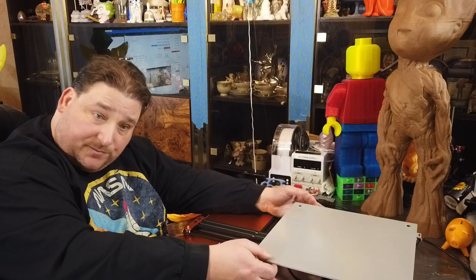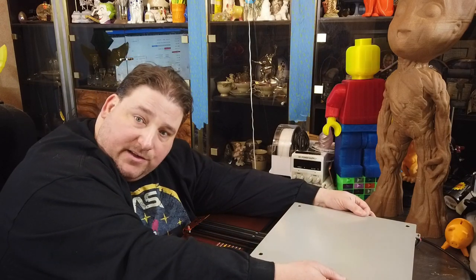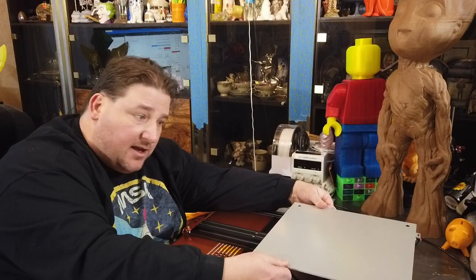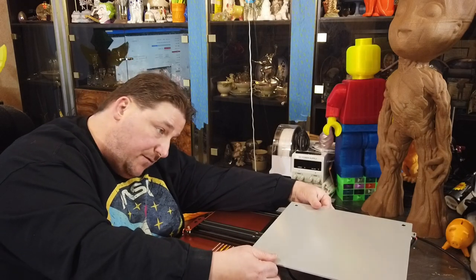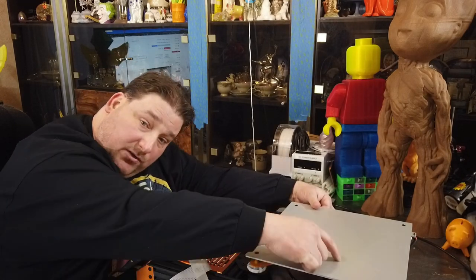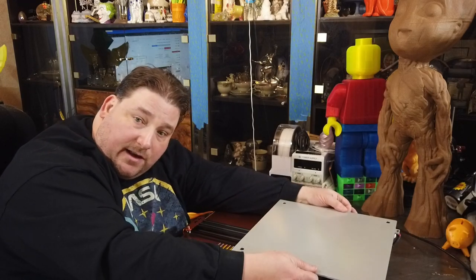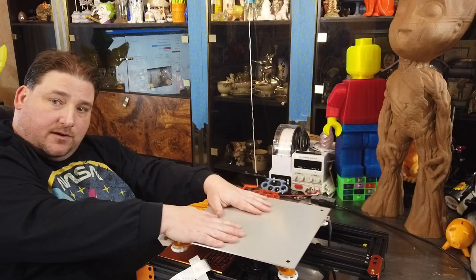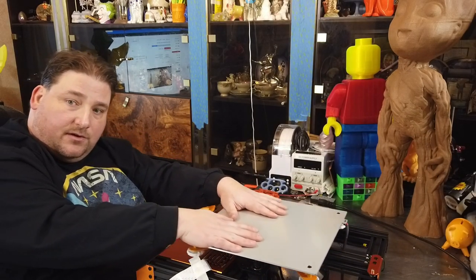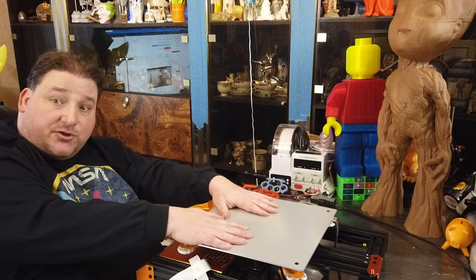Your bed's going to be loose, so this will wobble. You've got to check front and back so that you're checking both sets of wheels. What you do is you tighten up the wheels only enough to stop the wobble. If you feel carefully and look, you can tell which wheel is wobbling. So you can stop tightening this one, get to this one, tighten that up. Okay. And you want to make sure that when you roll this bed back and forth, you don't feel any divots. You don't feel any flat spots on the wheels. That's how you know: if you feel flat spots, you're too tight.